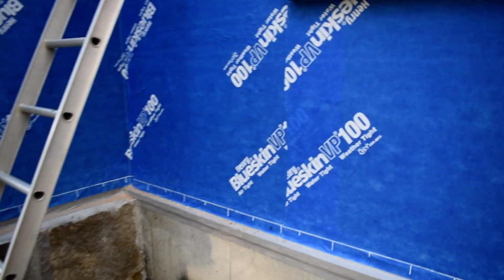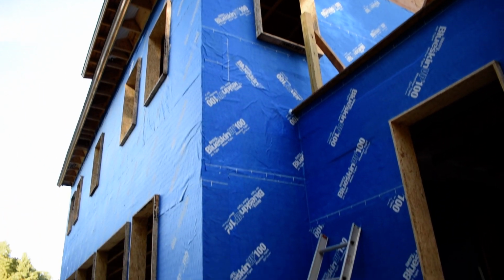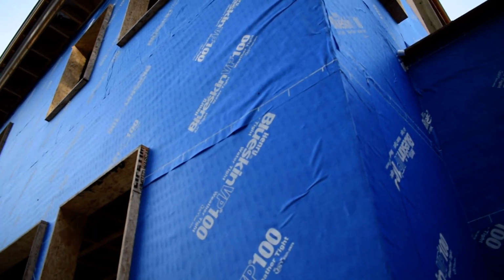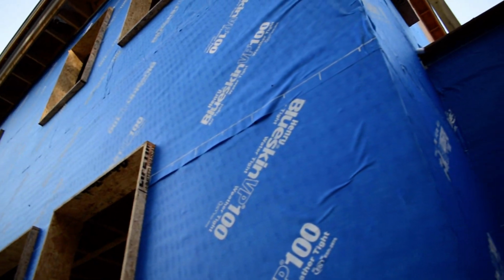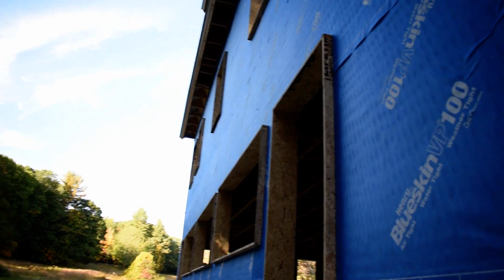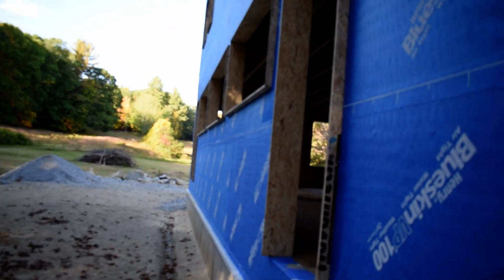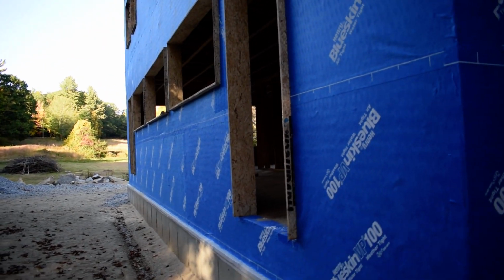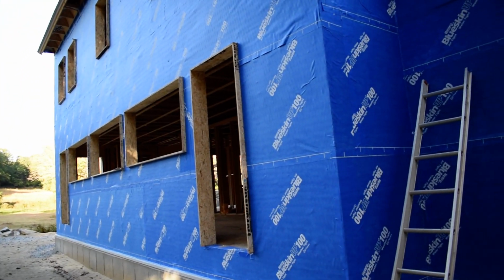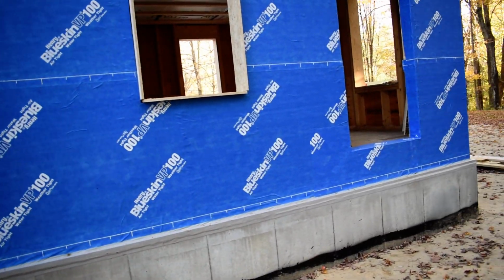But it looks like everything's nice and smooth and nice and flat, but clearly it needs to still get rolled out, and all these seams, this is not actually air sealed, so that needs to happen before they put everything in. And just looking down the side here, you can probably see some little nail pops and things like that. That's something that just irritates me. Quite frankly, it's irritating because it's hard to know that the next guy is really going to do it right before they cover it up with insulation, and then I never see it again.